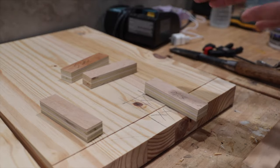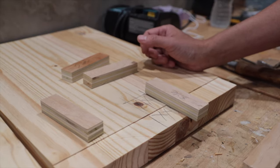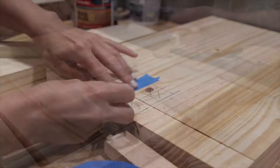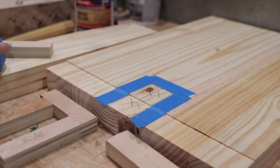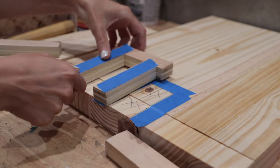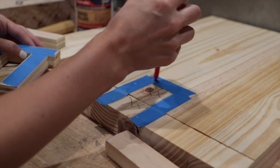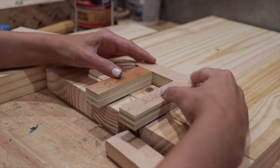And that way it'll be sort of the tightest fit, and then if we need to at the end we can adjust the fit by hand. As I was saying, if this was in my shop, I would have likely cut this notch out to accommodate the stretcher by hand, or used a crosscut sled on the table saw to at least define the walls of my mortise. We opted to do some template routing to decrease the sketchiness factor, even though Sam does have a SawStop. Safety first, folks. Then teamwork.